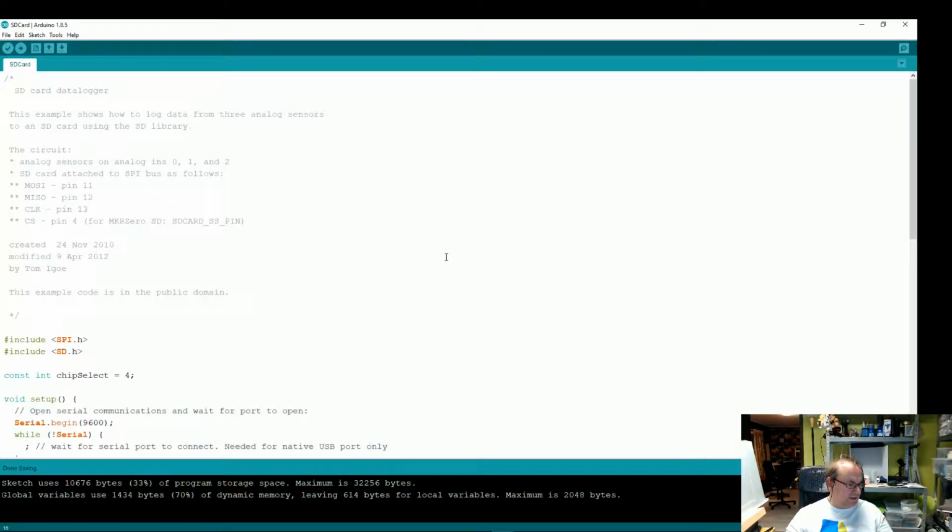And I can recommend this SD card reader. This is seemingly very easy to get working. And of course there are more modules than the one that I have. Even sometimes when you buy hats for the Arduino, the extra add-ons, you can have an embedded card reader on the board. Like the Ethernet hat for Arduino Uno, it has an embedded SD card reader. But I just think that these separate modules are a bit more flexible, because then one can connect them pinout wise how one wants.